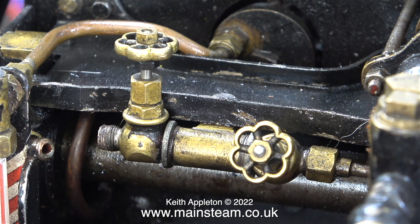Sean also said that the top of the water gauge dribbled — I'm not too worried about that. But then he mentioned there was a bit of a dribble from underneath these two taps, and when I look how slack the left-hand one is, I'm not surprised. The only problem is that to remove this tap entirely I have to move quite a few parts of the engine, which of course can be a problem because it's very easy to create more problems as you start the job.